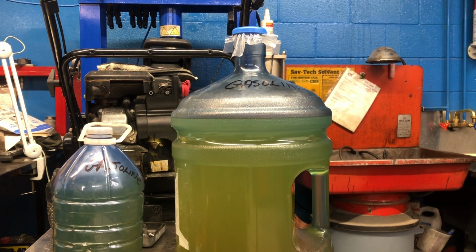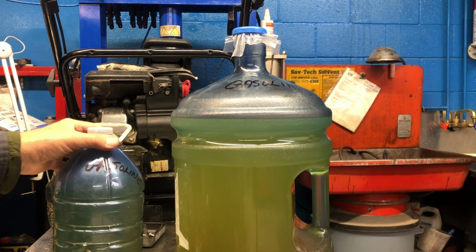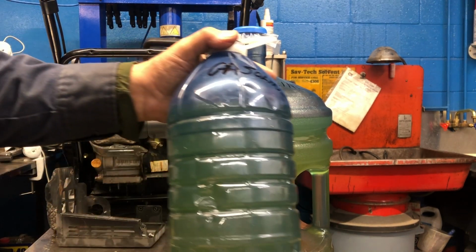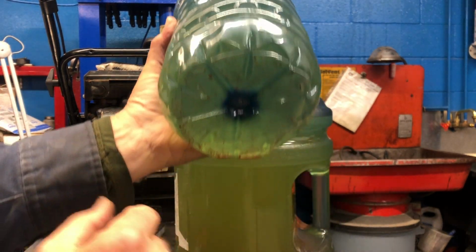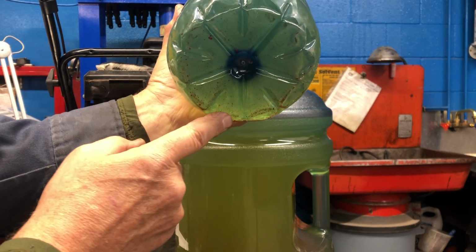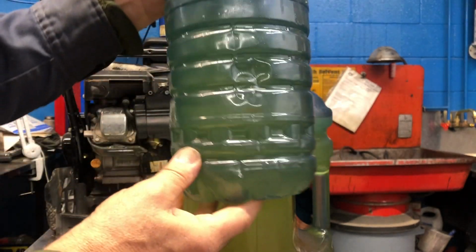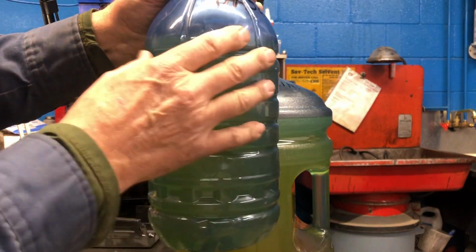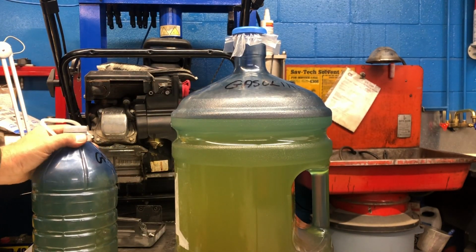From the contaminated 20-liter container, I was very careful to siphon off from the very top of the container 4 liters of fuel, and I added the food coloring to it, 4 drops. It's all at the bottom. It's all starting to mix back in to form one big droplet. So there is no ethanol soaked in water in this sample. This is just gasoline. What grade it is, who knows? Like what the octane rating actually is.